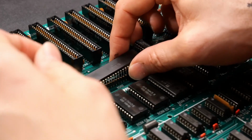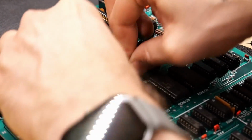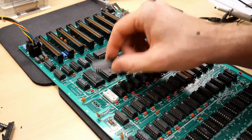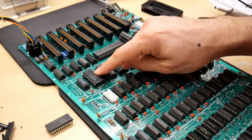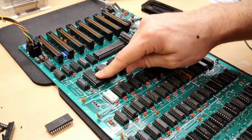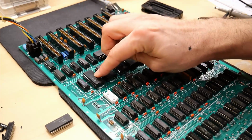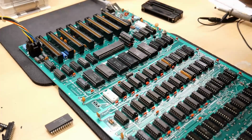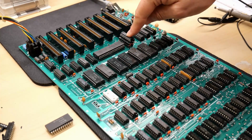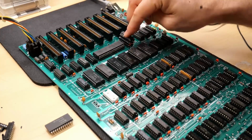And here is the original CPU. Let's put this back in here. There we go. Incidentally, I still have the original ROM chip back in here. This is the one for my spare parts. I'm going to keep this off to the side in case this is bad, but I actually really don't believe this is bad. I think I was going down the wrong path with that data bit 2, which had that clock signal looking bad. That actually sounded normal on this. It was all about that data bit 0 being stuck at ground when it shouldn't have been. And then when I pulled out the 8304, it went to normal. So I really feel that this was the only fault.